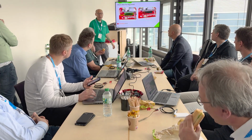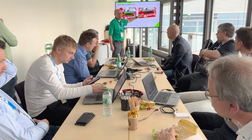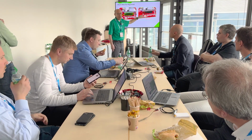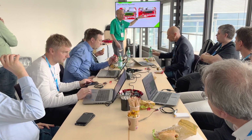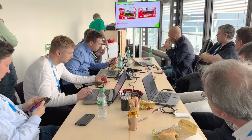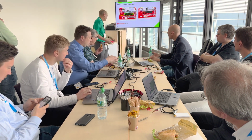So if you plug in your XBee and it's not working, the first thing to do is look and see, did I get all 20 pins into the socket? Because I guarantee at some point within the first week of using XBees, you'll be 1 pin off and bewildered. So that's a good thing to keep in mind. And then you move it back one, this won't destroy it, but it just won't function.